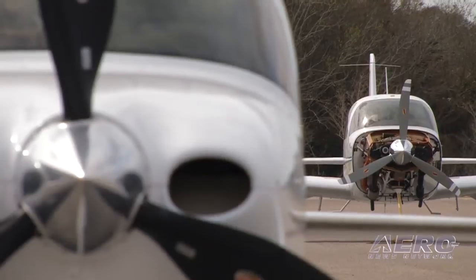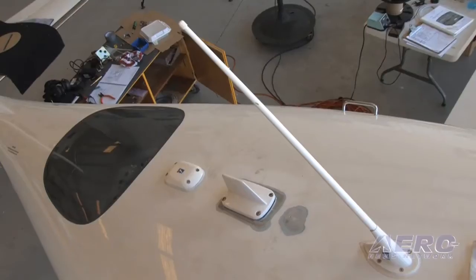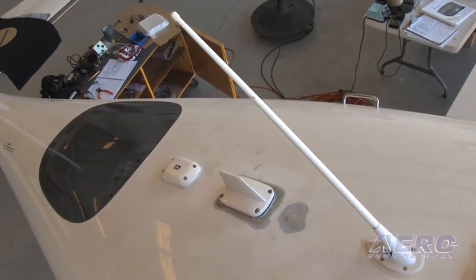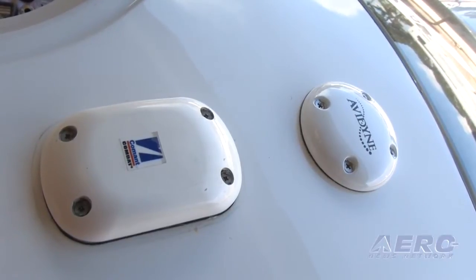Actually, the newer airplanes, it's still as relevant as the older airplanes. I'd definitely like to check to make sure antennas are all sealed up, because over time the sealant degrades around antennas. That becomes a big issue when it comes to communication or lack thereof, navigation problems, or in this case, GPS problems.